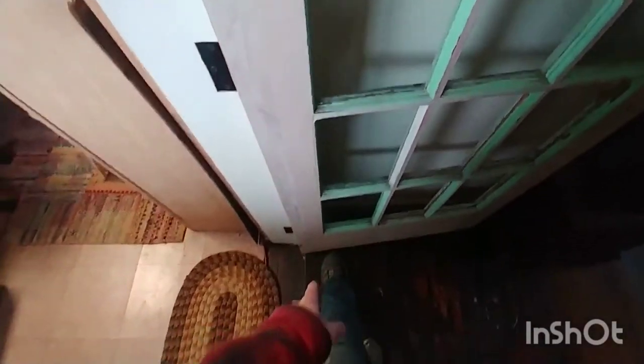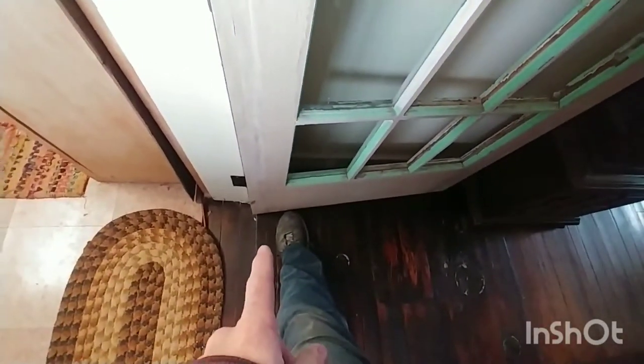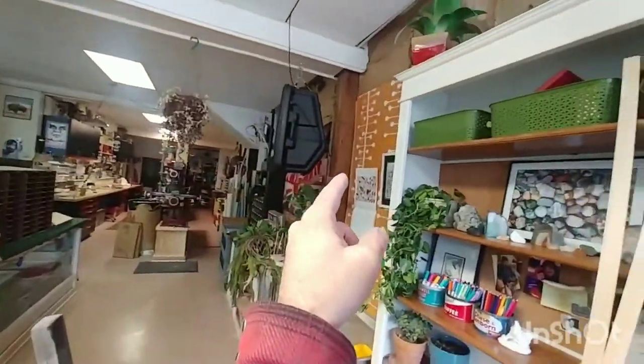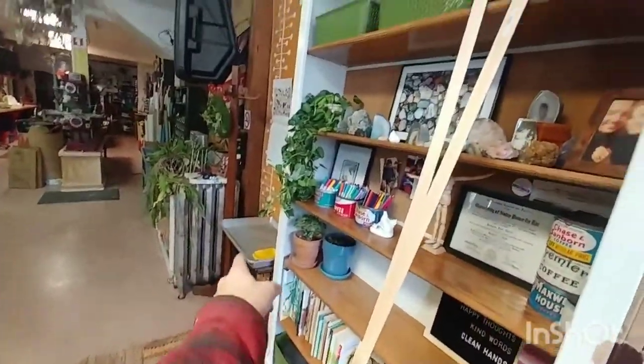Then I came over to the opening and set sheets of material on the floor here. Half an inch wasn't quite enough. 3/4 of an inch was just about right. Now the floor goes downhill severely here from the outside wall to the beam that goes through the middle of this building. And the second floor beam goes through right up there. Anyway, there's a post there, and there's a post right here at the confluence of these walls. There should have been a post there, but there's a post there. So it's low in the basement, and so this is low, and so this is low, and so the floor goes downhill.